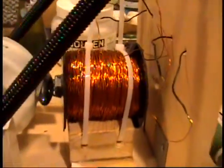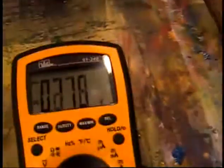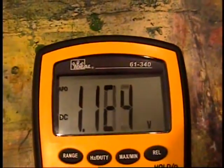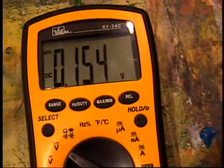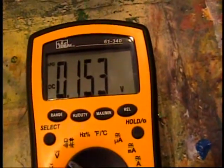I'll explain that with a brief animation. But first, let's measure the induced voltage that just the spinning wheel will give us. I've connected up a meter — it's reading a little energy right now, but that's just leftover energy hanging out in the coil. When I spin this, it generates a little electricity just by spinning past that coil, which is enough to energize the circuit and make the motor work. Let's go to that animation before I measure the actual flyback — the collapsing of the magnetic field through the run coil.